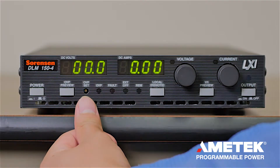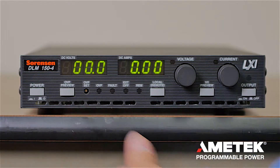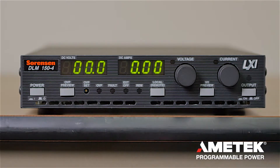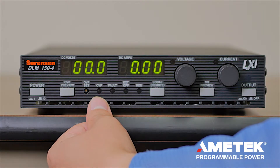The OVP set is a low potentiometer which you can adjust to set your over-voltage protection value. You can hold the OVP preview button while you adjust the OVP set so you know what your setting is. The OVP LED is lit when you reach your OVP set point and the unit goes to full protection mode.